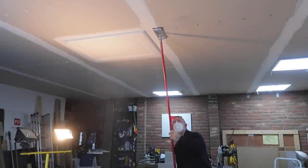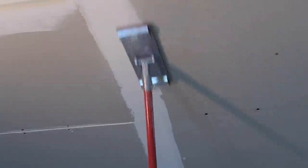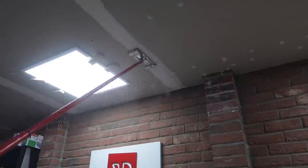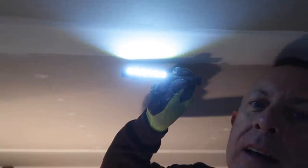After 24 hours it was time for sanding. I'm using a fine sandpaper here concentrating on the edges where it meets the plasterboard. During sanding expect everything in the room to end up coated with a thin layer of plaster dust - including your lungs if you don't wear a mask. After sanding this long tapered edge it's pretty flat, but every now and again there's a little indentation. I don't think that warrants re-skimming the whole thing - all I'd do is put a little bit of filler in. I think that is as good as I need.